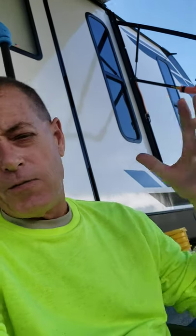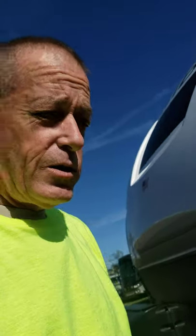What's up YouTubers, viewers, subscribers, and humanity of our beautiful world. I got a helpful tip today — I learned something last night about the water pressure settings for your toilet, so it's not blasting water out past your seat into your face. I learned that on a water pressure regulator. I'm gonna show you this water pressure regulator — you use it to adjust the pressure going into your RV or your rig. Let's flip this around so you see what I'm talking about.